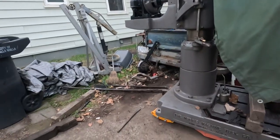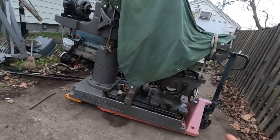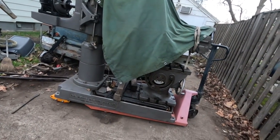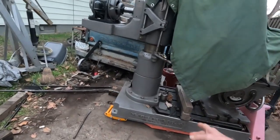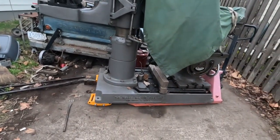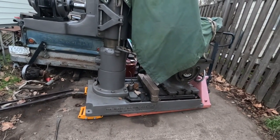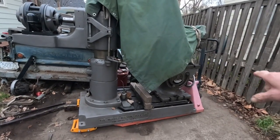I got this 6,000 pound radial drill. I got part of it covered up here. I got it coated with oil — it has to sit outside. But I keep it from rusting by burning a light bulb in there. I'd probably be better off with a 100-watt bulb, but I'm using a 60-watt bulb. Then I cover it with two more tarps.